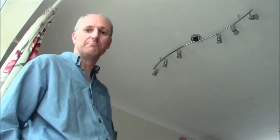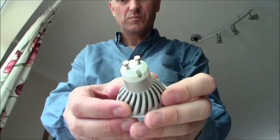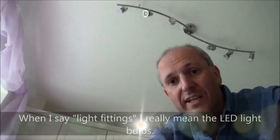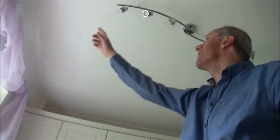These are GU10 bayonet mount fittings. Very small — they fit nicely in the palm of my hand. These are 5-watt GU10 spotlights, designed specifically for this type of light fitting, and available in any hardware store. In the main body of the kitchen we have an identical unit of GU10s — six in a string. These are the only LED fittings that have ever failed: two failures in five years, which admittedly is pretty good but not as good as advertised. They're meant to last 15 times longer than normal, so we've had to replace a couple, and you can spot one that looks slightly different.